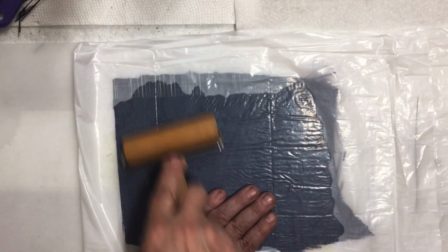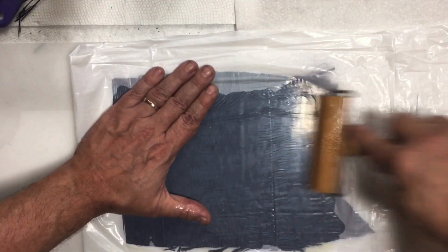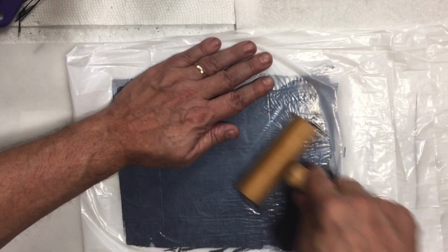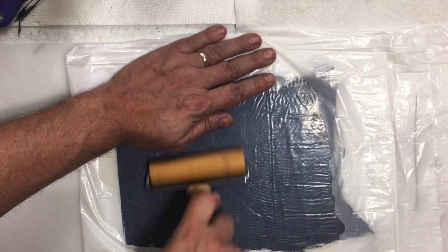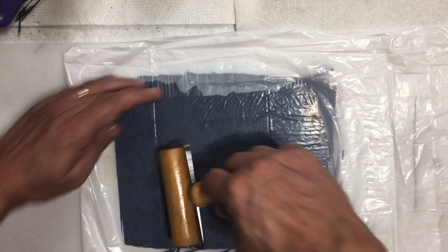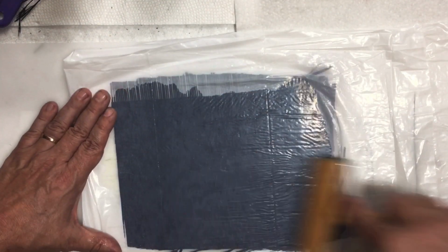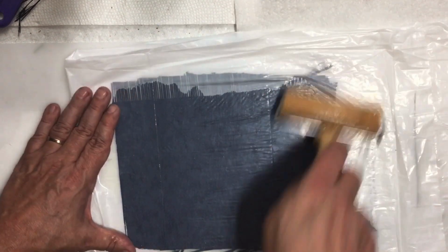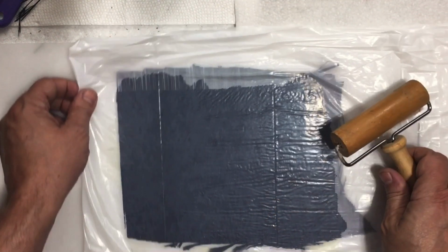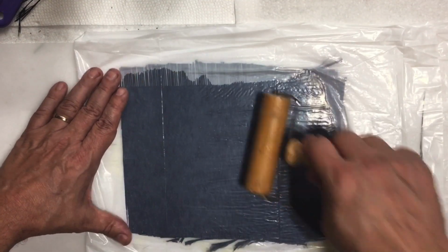the roller gets the resin all the way out to all the material, and it helps remove excess, because excess resin just makes more weight that you don't want. Now for what I'm doing, any excess will just get sanded off. But if you're doing something that's structural, excess resin does not make it stronger, it just makes it heavier.